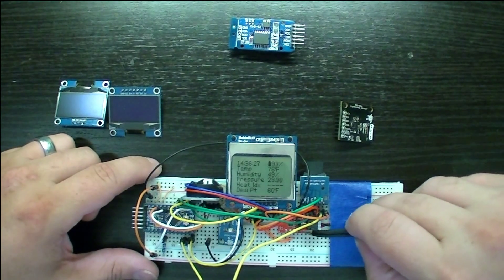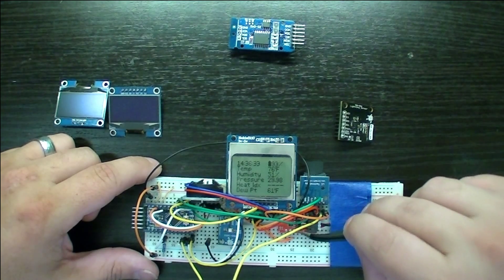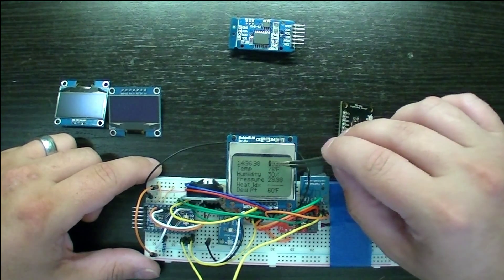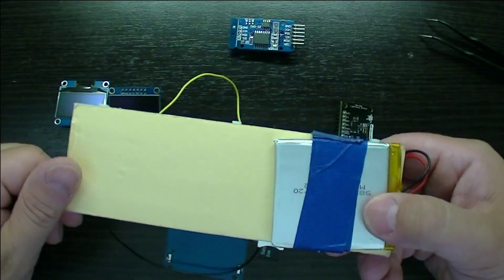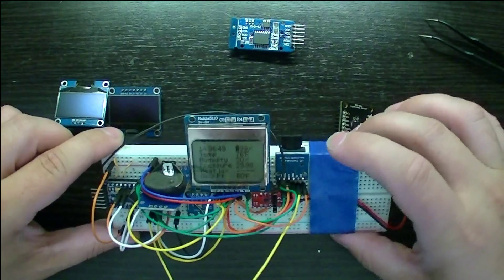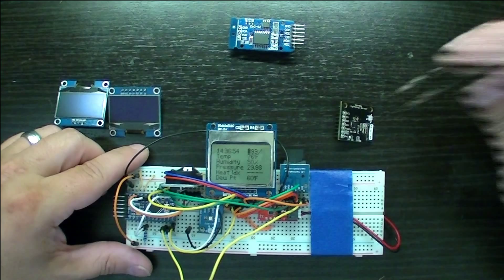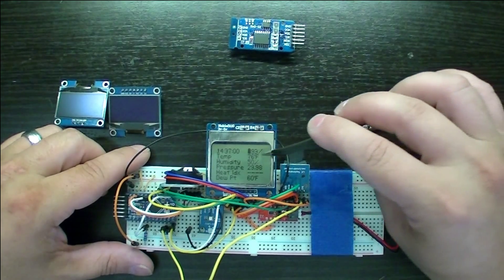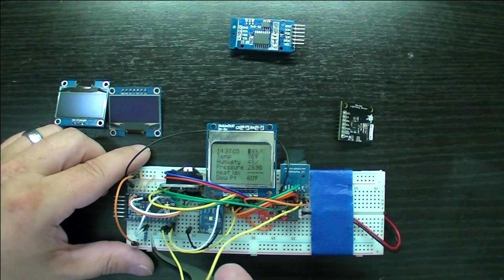The other board I have on here is from SparkFun — it's the fuel gauge, the MAX17043. That tells me the battery percentage shown right here for my test LiPo on the back. This one is giant, like 2000 milliamp hours. The final unit might have 350 to 500, if that. The battery is currently reading 93% and it's been running on this charge for 30 to 32 hours — so yeah, this battery is massively oversized.